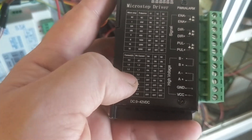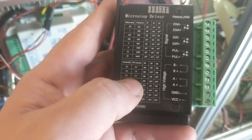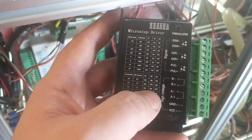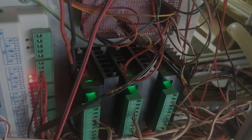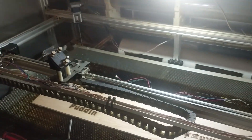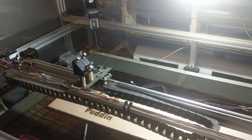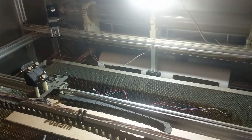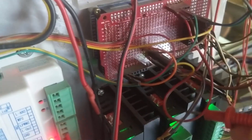What I want to do is turn it up to 1.5 amps. These are 2-amp motors, but I want to take it up to 1.5 first and see on the thermals what kind of temperature we start getting on that motor. All I've got to do is turn this very last switch off — on, on, off. Let's see how this motor operates at just under a half amp as is. It seems to get stuck; it doesn't want to move. So that motor can't run under a half amp — let's turn the power up.